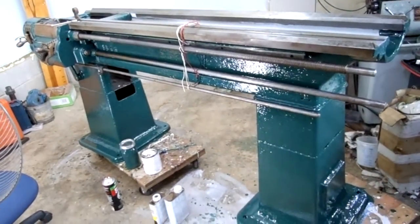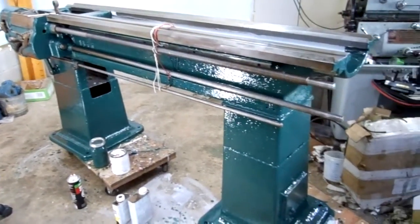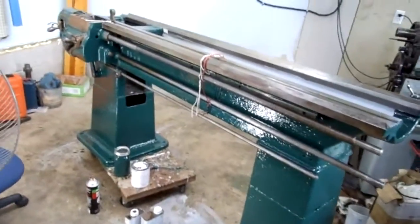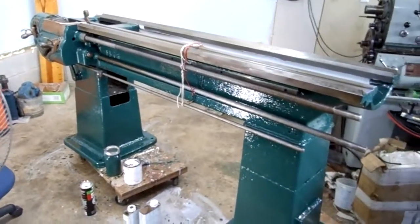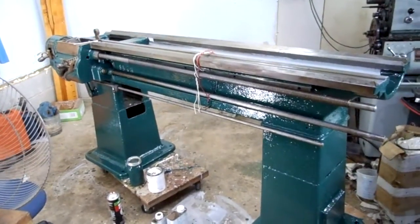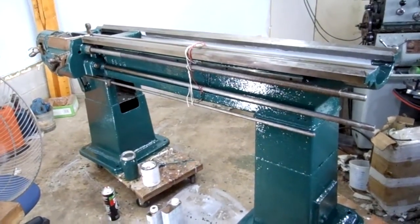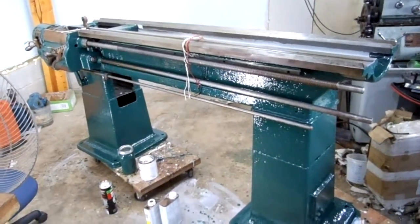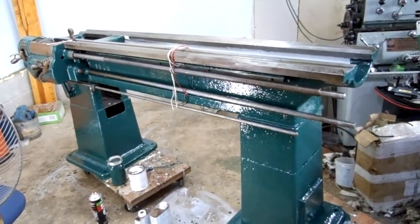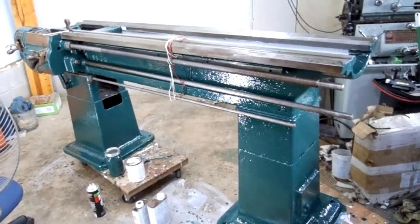There's a sewing machine company that makes very powerful motors. I found a company that makes a 1.75 horse, continuously variable. It's a DC motor and reversible and all that, all built in. All I have to do is make a mounting bracket for it and, you know, kind of get a pulley. It's a 5,000 RPM motor, which is very fast. It'll be great because I'll pulley it down along with the gearbox that's on there, a 4-speed, which will pulley it down also. And if I need it really slow, back gear is like 9.2 to 1 reduction, so it really will slow it down. And the multiplication of torque.